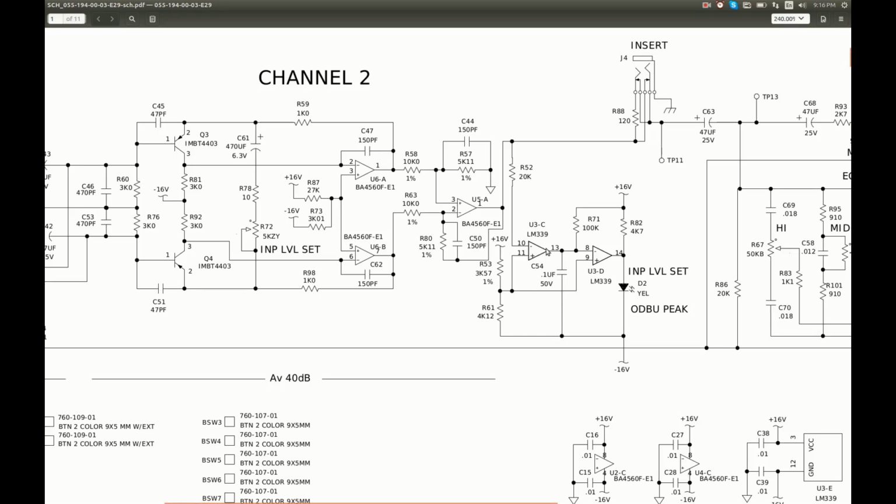And this thing relies on an external pull-up for that, which is this resistor. So maybe it's not pulling up as it should. Or maybe this capacitor is pulling down somehow. I measure about minus 12.8 volts at this point, and this negative rail is about minus 14.8. So about 2 volts drop across the capacitor. At least it's not shorted.